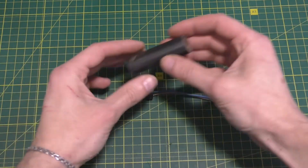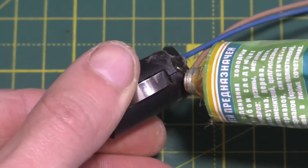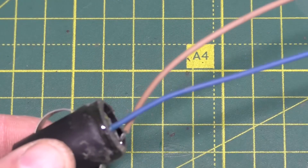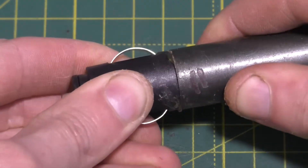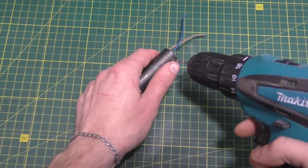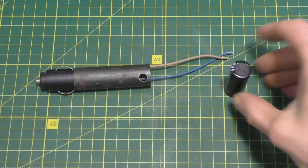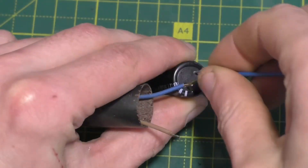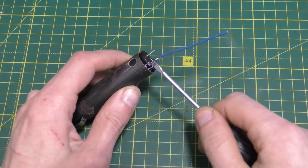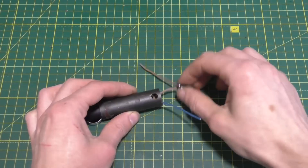Next you'll need a small piece of tubing that fits the connector by diameter. Apply glue to the connector and insert it into the tube. You need to drill an 8mm hole in the tube. Take a 2.75 µF capacitor and solder one of the wire leads to it. Insert the capacitor inside the tube, then solder the second lead through the button. Now secure the button.